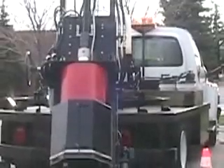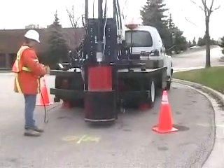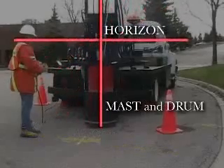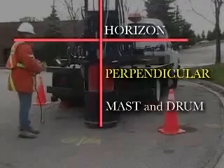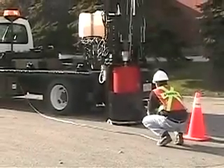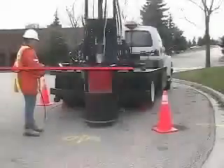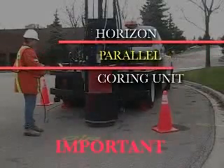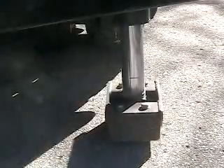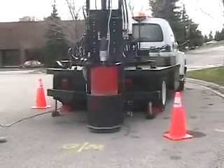Once the mast has been elevated to the upright or vertical position, you need to make sure that it is perpendicular to the horizon in both directions — not the surface of the pavement. Because your location can sometimes be on a slight incline, or because most roads are crowned and slant down from the center line to the shoulder to allow surface water to run off, you need to make sure that the coring mast and drum are at right angles in relation to the horizon, not the surface of the pavement. To help you position the mast vertically, you can sometimes use the vertical edge of adjacent buildings as a reference point, or use a bubble level. It is equally important to get the horizontal angle of the coring unit parallel or level with the horizon. To do this, you will need to deploy and adjust the rear stabilizers, which will alternately raise the passenger side and the driver side of the coring deck to bring it and the angle of the cutting edge of the coring drum in line with the horizon as well.